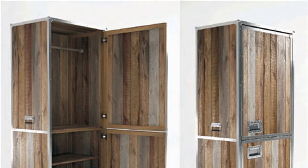If necessary, apply a few different finishes and colors to a scrap of teak wood. Once the paint or polyurethane has dried, compare it to the chair's finish to determine which one matches. Step 13: Drill a hole through the top of each chair leg to make it easier to mount the leg on the chair bottom.